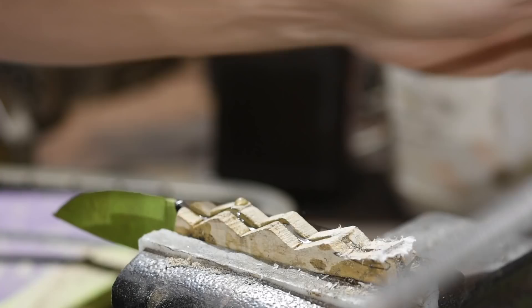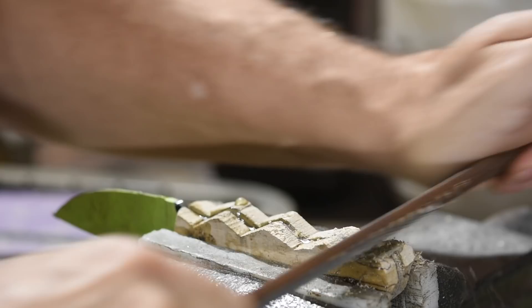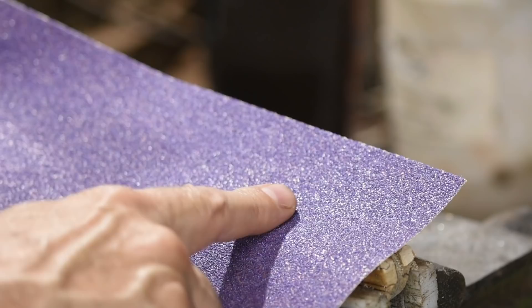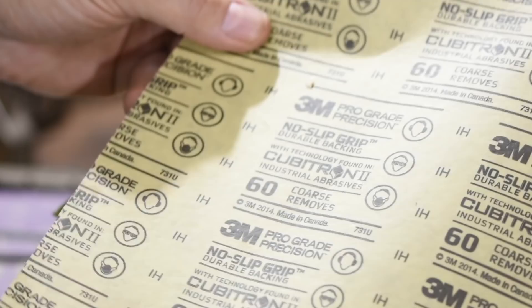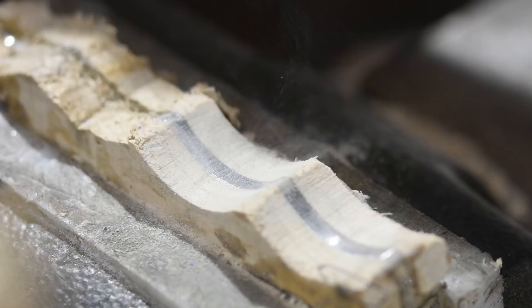Now to the finger holes. You can use a round file, a half round, a radiused rasp, whatever. If you don't have those, a flat file will do in a pinch working in with the corner of the file. Once you get close to the steel, swap out the rasp or file for your trusty dowel and sandpaper. Use a real heavy grit like 40, 60, 80 — something in that range and you can really make pretty quick progress here. Side to side to profile everything, then spin it to get a smooth surface finish on the steel.